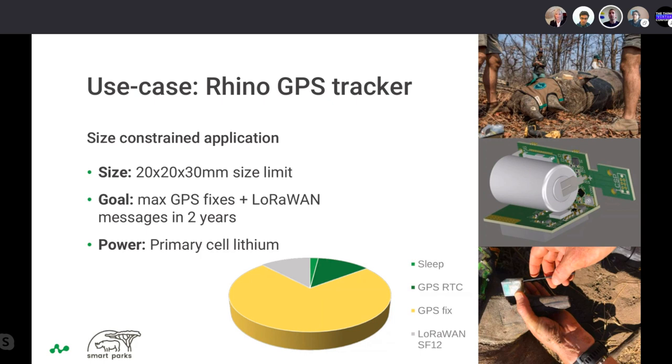to deploy fewer gateways. But for example, in the park where the elephant tracker is active, we have about 16 gateways active on very high locations. Sometimes we even have towers of 30 meters built, but sometimes we use huge mountains where we only need 5 meter towers. But usually we use the Kerlink iBTS with antenna diversity, so we tend to use two antennas to really get the maximum out of the gateway.